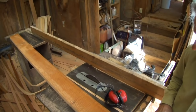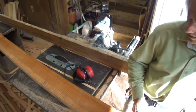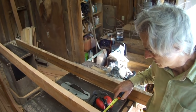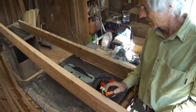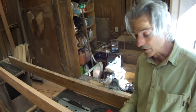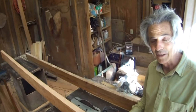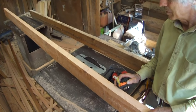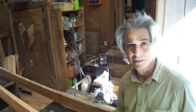Now it's dimensional lumber — six inches everywhere and pretty straight. It's relatively simple as long as you have the right equipment, though it is labor intensive. At some point it'll make more sense to have a swing blade mill to mill lumber with, especially since maintaining six buildings makes that a good idea. Probably next year one will be built. But for someone milling up just a few logs, this is a great technique that doesn't cost very much.